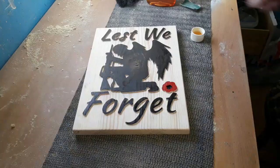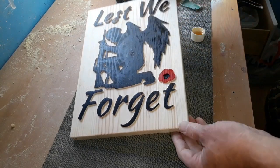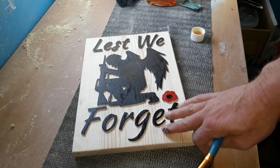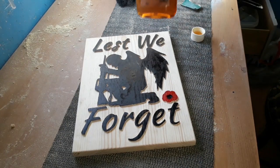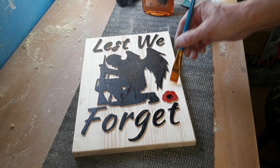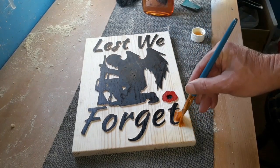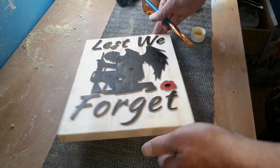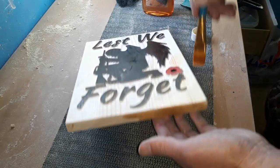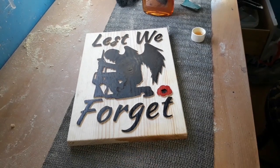That's all the painting done. I would have preferred to do the background and leave the lettering, but this is what the chap wanted so this is what he's going to get. The wood's just a little bit too light for me, so as always for me: linseed oil. I'm going to give it a nice coating just to tone the wood down a bit — you'll see as soon as it goes on it just darkens it enough and brings the grain out on the wood. We'll cover all of this with linseed oil, let it dry out, and then spray a bit of varnish over the top.